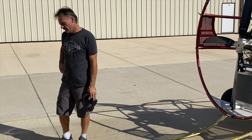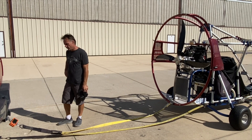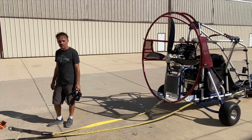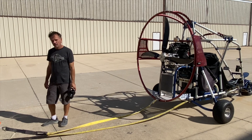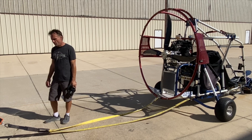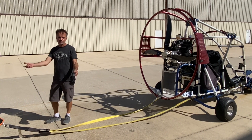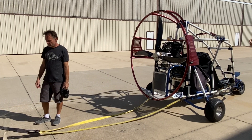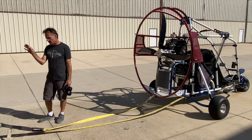Takeoff at about 4,800 RPM would be nice — you get around 400 pounds of thrust and it'd be a quiet machine with lots of torque. There's no reason to be up at 6,000 RPM. It's nice to see 435 pounds of pull, but even if you get 400 on the ground at 4,800, as soon as you take off the propeller's going to increase. It'll be interesting to add just two more degrees just to have a complete set of data.